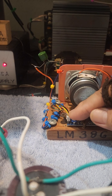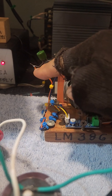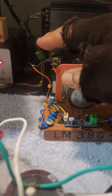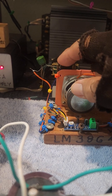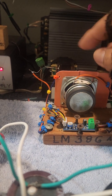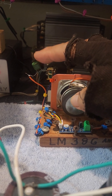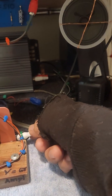These are four wires over here. So the red and black, I bring it out. These are the red and black. So this should be the plus terminal of the input voltage, and this should be the negative terminal of the input voltage. And I put in parallel with it a high frequency capacitor to reduce line interference. For the audio not to have any interference, we must place this one. So any interference coming from the voltage source will be diverted immediately to this high frequency capacitor. The other two terminals go at the back, and this is actually the audio input.